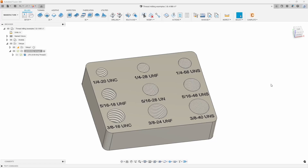So what I've done here is just created a quick simple test block, and on this test block I've used Fusion's hole command to go ahead and create some tapped holes. I put on some cosmetic threads in there just to indicate that those are tapped. I've also created them in three different diameters, ranging from a quarter inch to three eighths, and going from left to right I made them from coarse to fine so that we can try a couple of different thread pitches on the same diameter.